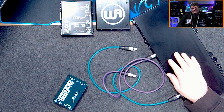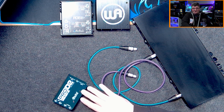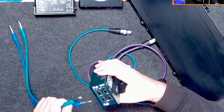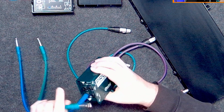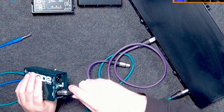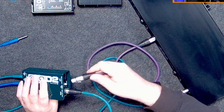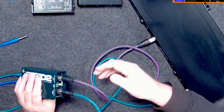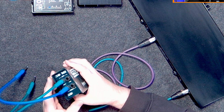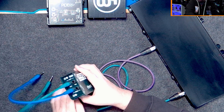To take advantage of a two channel microphone preamp as part of an effect loop on our two bus, we need to use a two channel DI box. We'll have connections coming in from the audio interface right and left into our DI, then bring those connections out using the balanced XLRs. We need to make sure we keep the channels correct and not get them backwards. The only other consideration will be signal level — depending on what output is coming from your audio interface, you may want to take advantage of the pad function on the DI.